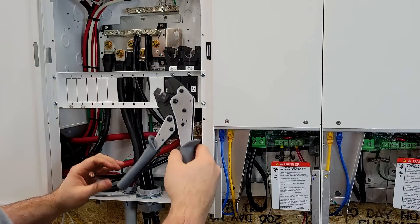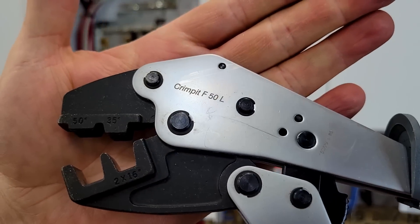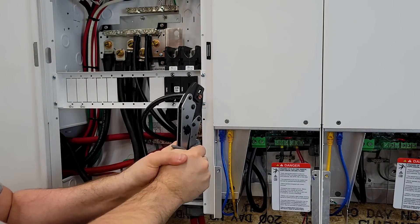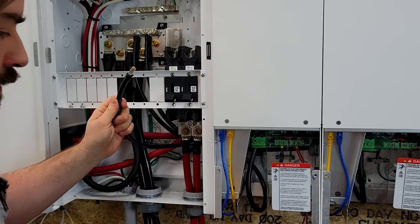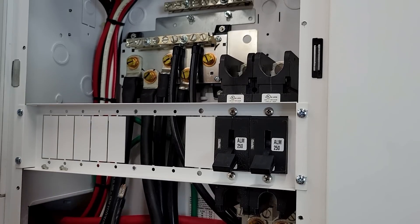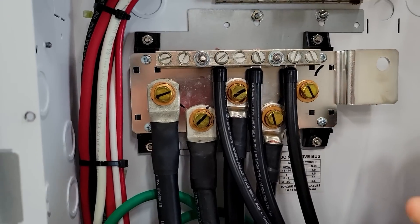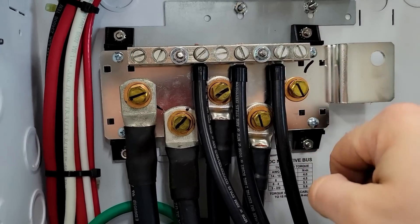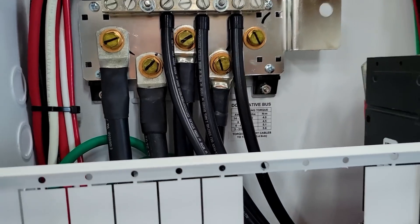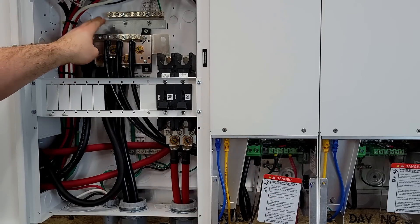I'm using a crimper that was really expensive because I wanted one that met the UL requirement. I line it up with my Sharpie mark so the mark ends up right in the middle of where I crimped it, meaning the ferrule will fit right in the middle of the bus bar terminal. Now you can see I've got all three charge controllers coming up to the negative bus bar. These two 4-gauge wires go out to the inverters, and these two 4-gauge wires go down to my external bus bar for the battery. The negative wire goes from the charge controller directly to the negative bus bar, while the positive makes a stop at the circuit breaker.